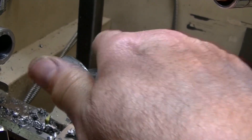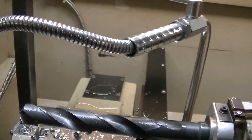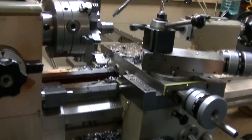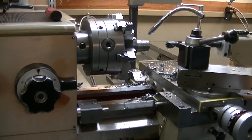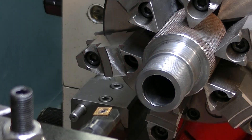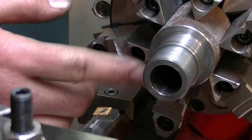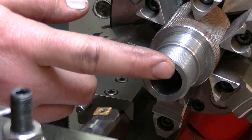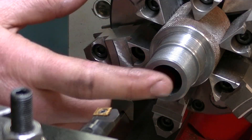That is warm to hot, which is amazing. This is the first lathe I've had that has flood coolant built in, and what a game changer that is. Mist coolant is great, but does not work for long boring. So after drilling that with — I think that was a 7/8 bit — that bore is actually really quite smooth. But I'd like to get it to 1 inch so I can pass through the largest size bar through a 5C collet.